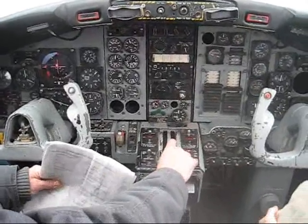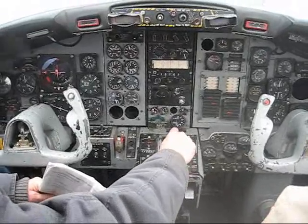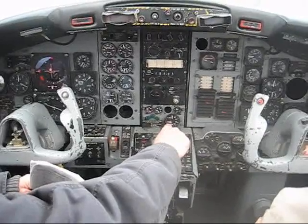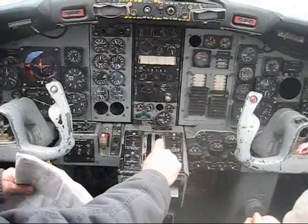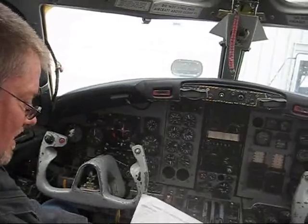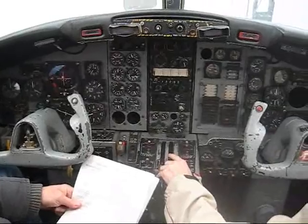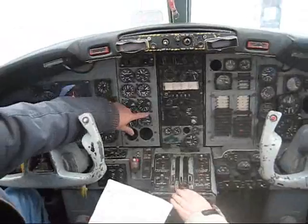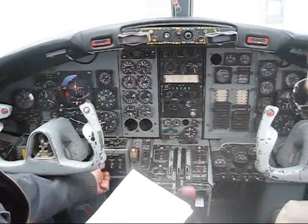While you're on the idle stop - I'm just sitting there for a minute. When you move that throttle, if you go rapidly with it, it's not going to respond. You've got to wait for it. So if you just go a little bit - 1,000... 1,000... 2,000 - it takes a little while to get up there. And then come back the same way: 1,001, 1,002, 1,003. You've got to wait on it. That's your acceleration and deceleration. If you're ready to shut it down, I think we're ready to chop the power on this. Just going straight back - that shuts it off. Our EGT's dropping, our RPMs are coming down. I'm going to shut off anti-collision because that's kind of noisy.